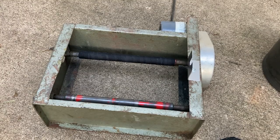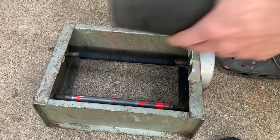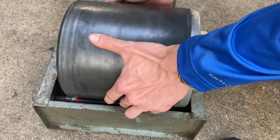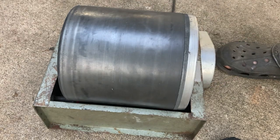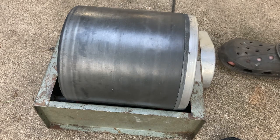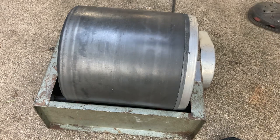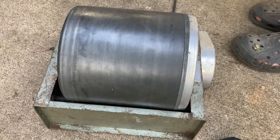I've got only the one side all wrapped up because that's the only one that's driven, so now is the moment of truth. At first I thought it was an issue because I tested it with just empty barrels, but earlier in the video that was a full barrel and it was still slipping, so clearly it needed more friction. Let's try it out.